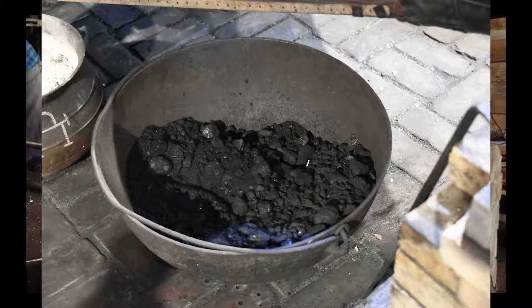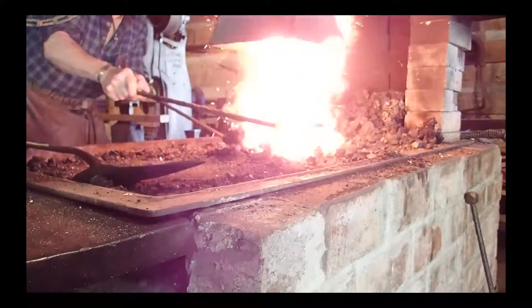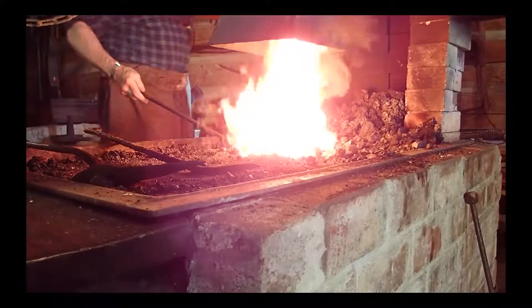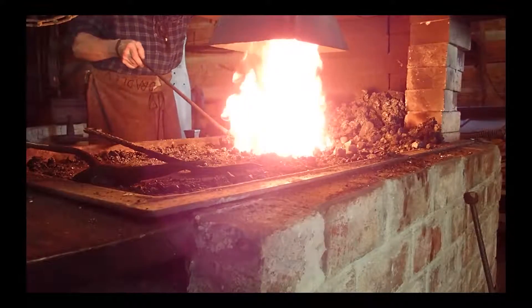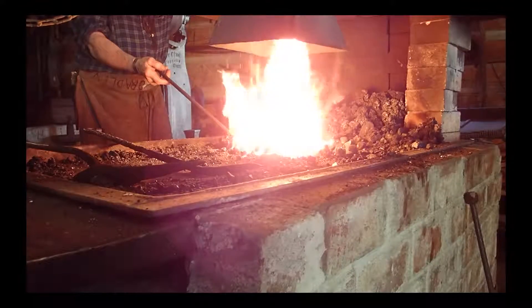Just above the coal kettle is the bellows. The bellows are made of wood and fabric. They expand and draw air from inside the blacksmith shop. And then as they close, they squeeze that air out of the bellows, into the nozzle, into the forge. That extra air and the oxygen it carries causes more of the fuel to ignite and start burning.